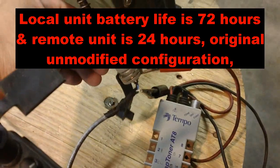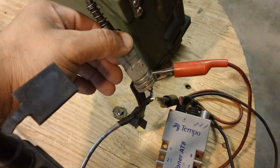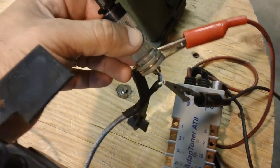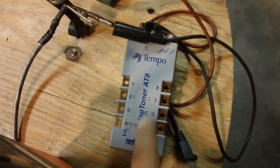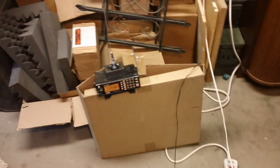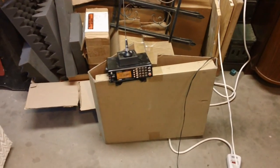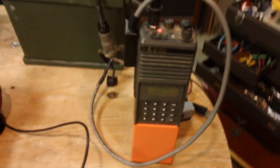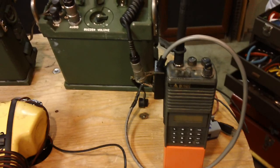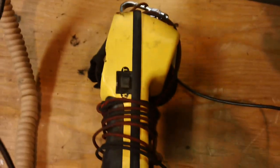So now the remote unit could talk over the radio for another ten hours or so. Remember I said I couldn't transmit my voice because it'll be too low? So I cut the microphone line and placed this toner in, so it'll send out a tone over the air to let me know I'm transmitting. I'll demonstrate push-to-talk — it's going to go from this set to this set, and there's my scanner on the same channel so you can hear it. Red light — it's transmitting.